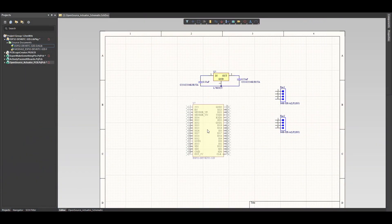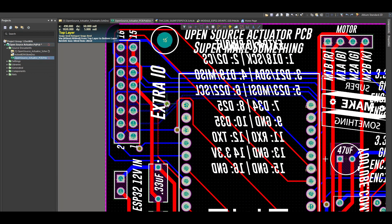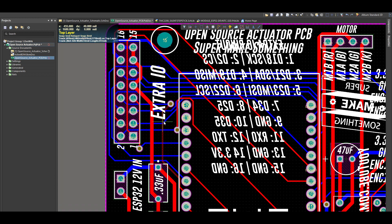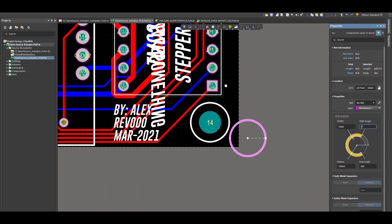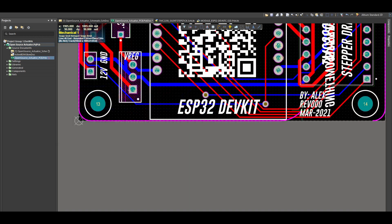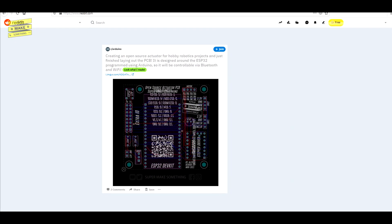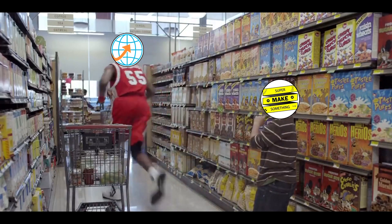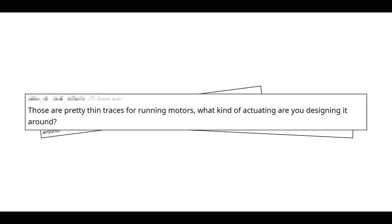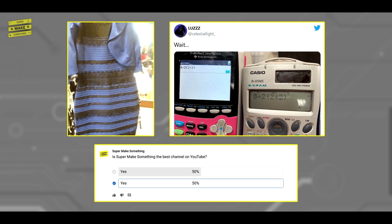Designing and laying out circuit boards is one of my favorite parts of DIY electronics projects. Fitting all of the circuit connections onto a tiny board and routing the wire traces to make sure that everything is connected correctly is like a miniature puzzle, and is not only super satisfying when everything works as intended, but also creates a really cool-looking graphic when the board is fully laid out. After I finished my initial actuator circuit board layout, I took a screenshot of my PCB design software and excitedly posted it online, where I received surprisingly consistent feedback: my circuit board traces were too thin.